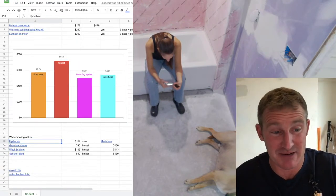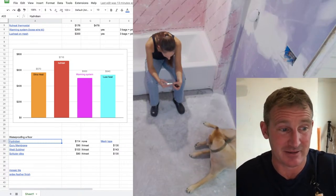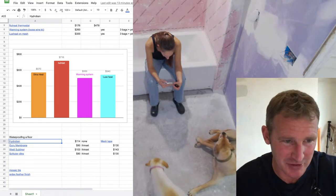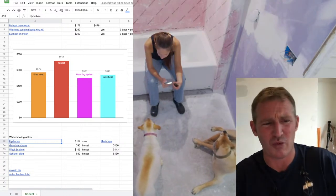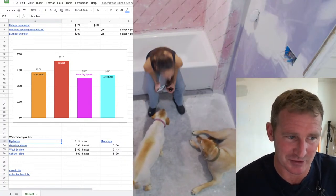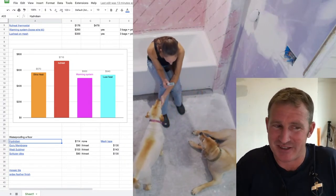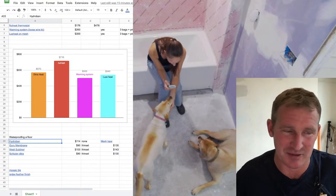It's actually a little bit cheaper than these other systems, because it's just a gallon of Hydro Ban, and then we're going to do the mesh tape. With the mesh tape, you are looking at about $130. They're all relatively the same. About $130 for any standard bathroom to waterproof, I would say, is pretty normal. So when you're price comparing waterproofing on something like this, it's a net gain. It's all going to be pretty much the same.